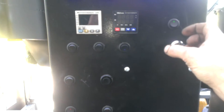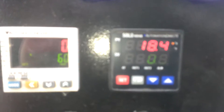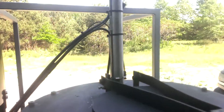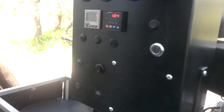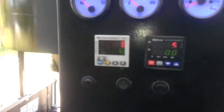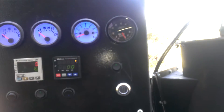Let me turn the system on. That is in Celsius — that's the control located here in the reduction zone. This here is a timer for the auger. When the cylinder extends fully down, it trips this switch here, which turns the timer on. The timer in turn trips the valve to put it into a retract position. When that sensor is made, that operates the auger. It will go for a time parameter, and once it hits the set point, it will shift into an extended position and continue the loop.